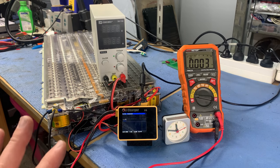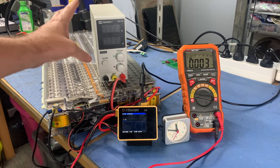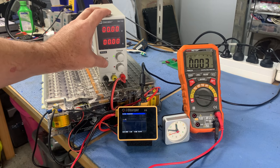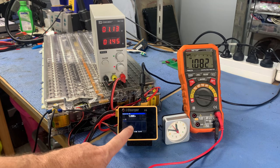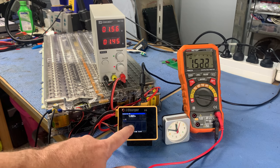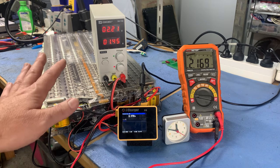This is my little test rig that I plan to use to try and recover this battery with. I'll just do a couple of minutes worth of testing here so you can see the results of the shorter tests, and then we can do some longer tests. We've got an iCharger X6, a multimeter, and a charger. The iCharger will let us see all the cell voltages. So if you turn this on — we've got one and a half amps and just a handful of volts. This is a 22-volt battery and it's coming up to one volt. We haven't got any cell data yet because the cells aren't high enough, but as it comes up in charge a little bit it should actually populate the cell voltages. Almost got two volts there.